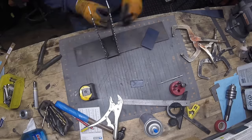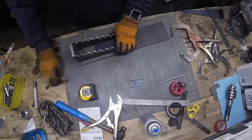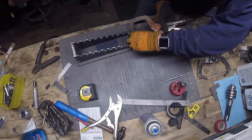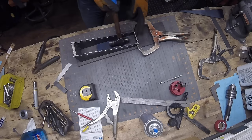The next piece that we will weld is the top piece. At this point the frame was not quite square, but I'll show you how I dealt with that in just a minute. Here's the top plate that we're going to tack on, and it's fine to do this because even with this welding in place I can still move the frame side to side to square it up.